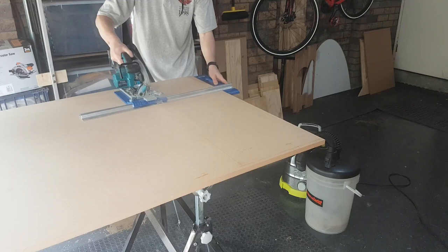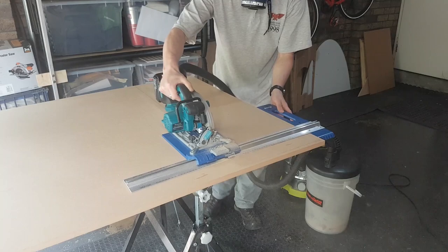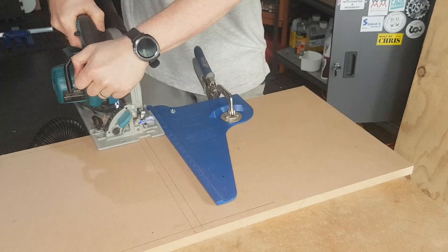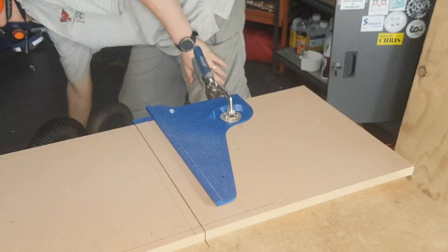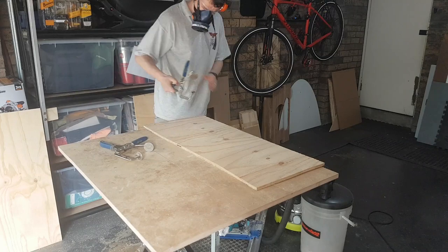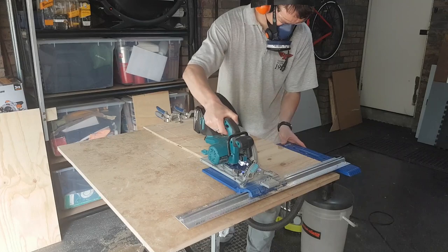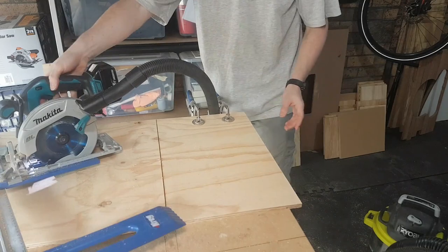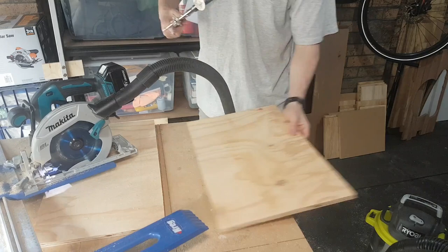Marking a 12mm gap so that we have a space for the wood. Obviously your dimensions are going to vary, but I love the Kreg Rip Cut here because I can set it very, very accurately to the size that I want and make repeatable cuts. Back on the square cut — you'll notice I'm not using my table saw; I actually had to pull that apart because there are some big things coming for that in the near future, so we are back to basic tools. These are the 12mm ply sides and I'm cutting the heights, set just below the lip of the vacuum cleaner. The rip cut just leaves them exactly the same height — these are the short sides for the box. Very, very quick and repeatable.